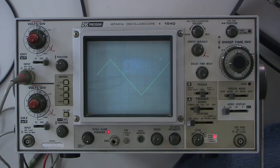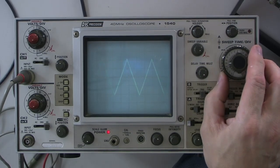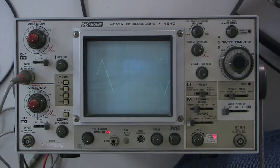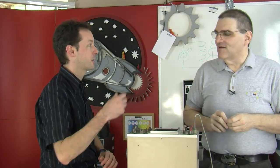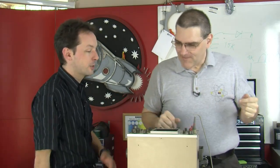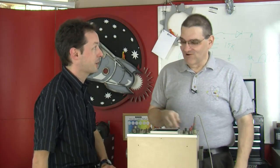You can do timing measurements with this. I use it mostly when dealing with microcontrollers where I need to know timing on a particular event. I've actually timed software by toggling an output port pin, doing something in software, then toggling the bit again, and putting my scope on that pin. I can see exactly how long it took – I'm getting a direct timing of a software subroutine from the oscilloscope. On a faster computer it would take less time.